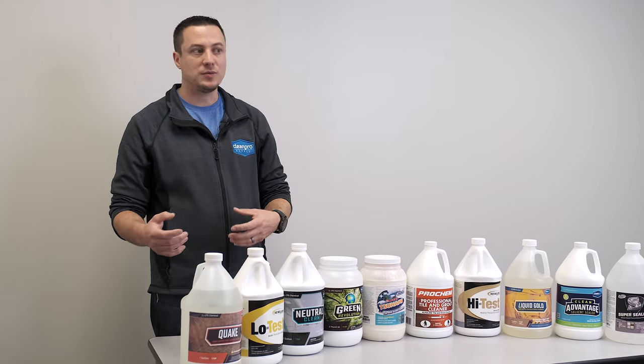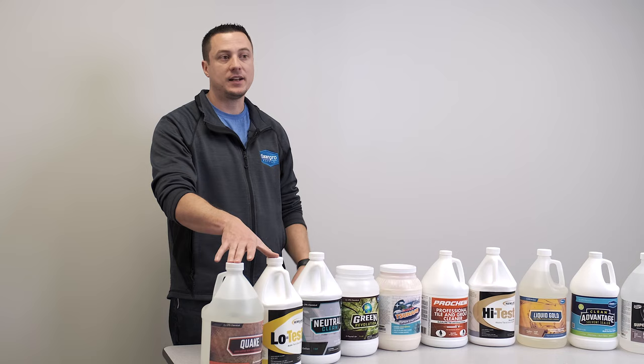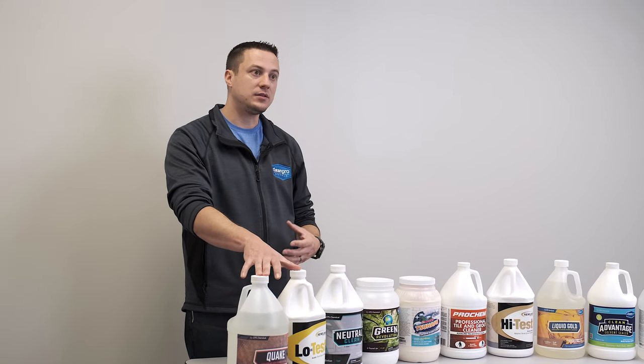Clean using these alkaline products first. If there's any staining that remains, use an acid. Now if you're in a restroom — usually commercial — I would personally recommend cleaning first and then doing an acid wash on the entire floor, especially around the toilets and urinals, because this acid is really going to get that grout cleaned up. It's also going to help with odor — if there's any urine odor in the grout, these will get that out. You can use other products afterwards, maybe some peroxides if needed, but usually with an alkaline and then an acid in restrooms, you get a really good clean floor.